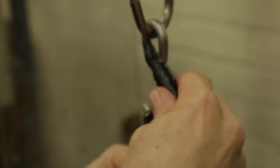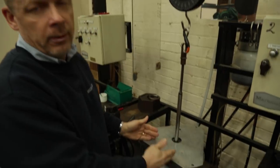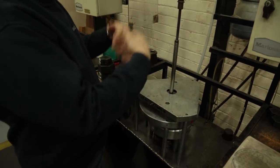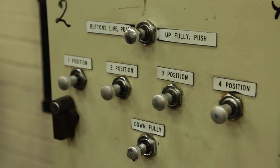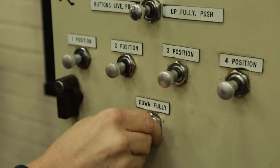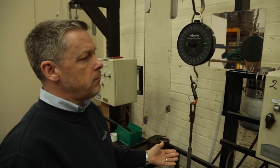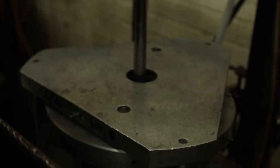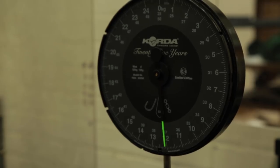In principle we are taking the certified weights here and the machine allows these to fall away so we can apply weights one after another up to a maximum tolerance. In principle we drop the table away — it allows us to record a weight and also to monitor the balancing of the scale. Here we see a 12 kilo weight on a 50 kilo scale.